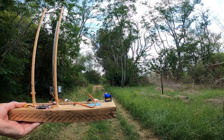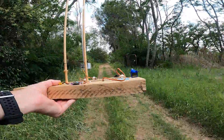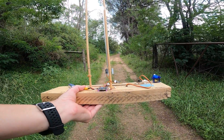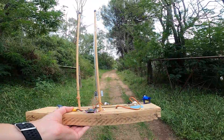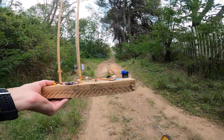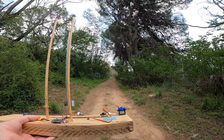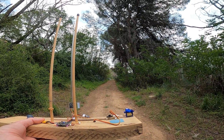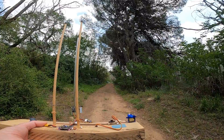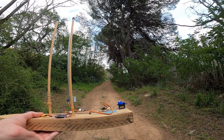We're getting what looks like a lot of micro failsafe at 86.3 meters, and at 95.5 meters — I'm hoping you can see what's happening to the LED so you can make up your own mind about the receiver. That's definitely failsafe now — continuous failsafe at 104.4 meters. It's completely in failsafe, but we were losing signal within the last 20 meters.